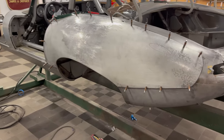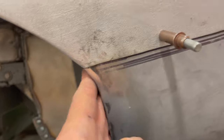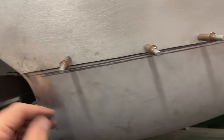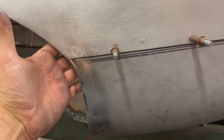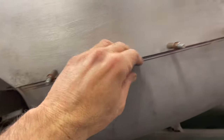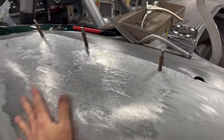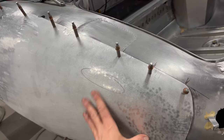It's all tucked in there and it's a nice smooth fit. I've got the clearance I need for the tire, it's feathered in nicely, and the angle here is good too. I've got it trimmed off with one inch all the way around. You can see the progression of scribe lines — my first shot, my second shot, and then where I grabbed both and pulled them out. All my clecos are in there, it's nice and smooth, I just need to sand and scuff it down. There's maybe a little dent there I'll mess with.